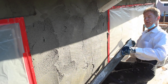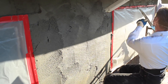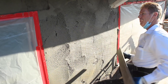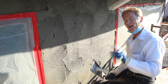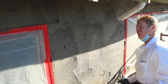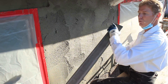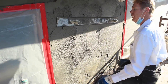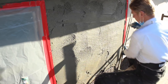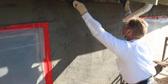To get a straight straight edge — remember, we've got a wall fat and ugly, meaning there's a lot of stucco on it. This stucco is about an inch and a quarter. We want seven-eighths of an inch. These windows are going to have to have a quarter-inch reveal — quarter-inch reveal, guys, all the time unless it's some weird specialty thing. The darby is wet. If this darby was dry, it would pull off the stucco, just pull it off the scratch coat, because we're doing the same-day system. I'm just trying to get my middle section — get your middle.